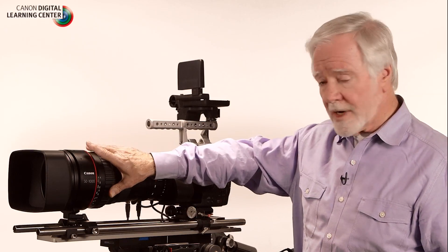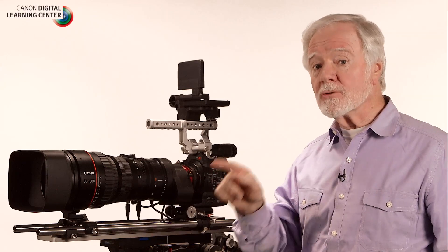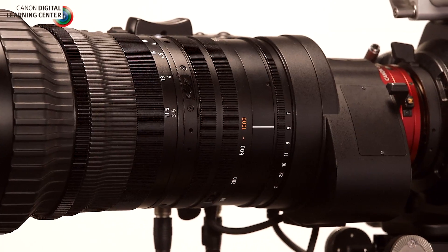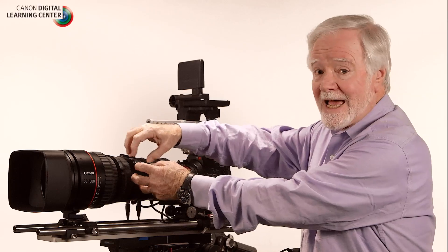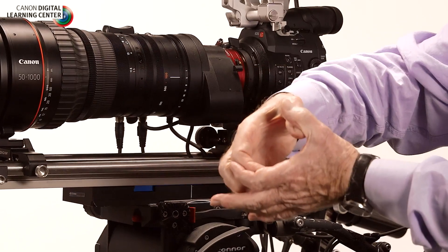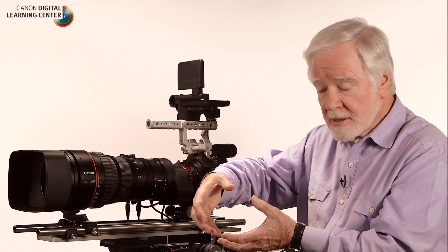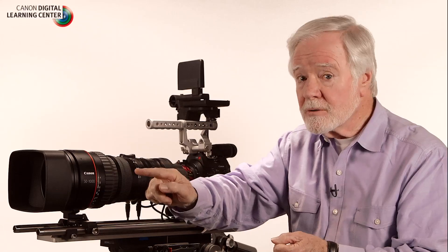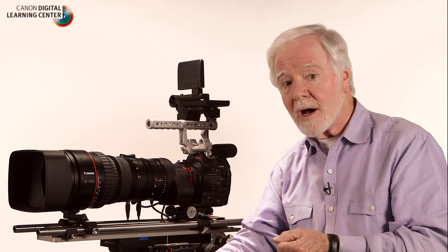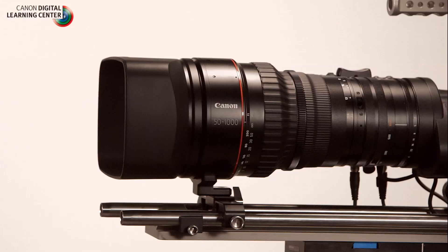Another constraint determined by the input focusing group is ramping — the T-drop that takes place in most long zoom lenses, regardless of format. By a change in color, we'll give you an indication of when ramping onset occurs. As you go towards the telephoto end, the image inside the aperture — called the entrance pupil — starts to grow. When that entrance pupil diameter equals the diameter of the focus lens group and you continue toward telephoto, you can get no more light and the light will start to drop. This is fundamental optical physics, true of any zoom lens in any format, and it puts constraints on size and weight.